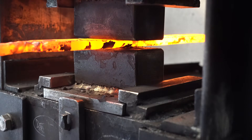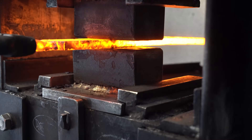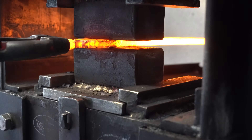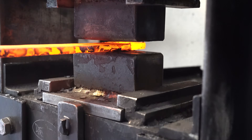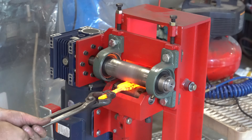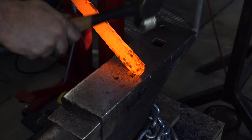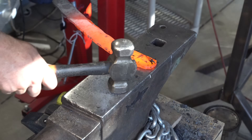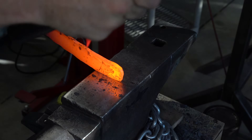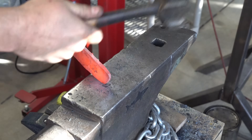Now I'm working to reduce this billet down to about 300 thousandths of an inch — that's going to compress those twisted layers. We still need to grind some off, but first we need to forge this more into a knife shape. Here I'm doing a quick run through the rolling mill to make sure it's a constant thickness all the way through. Then I start the hand forging — first putting a curve into the blade, then putting the tip in. The Turkish twist pattern looks odd if you cut into the billet, so it's much better if those layers compress as they get to the tip.